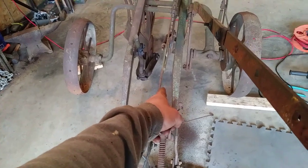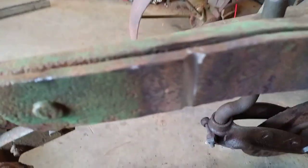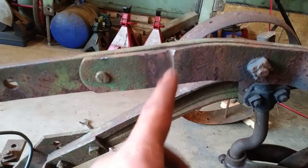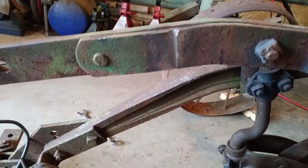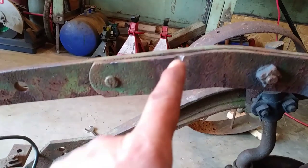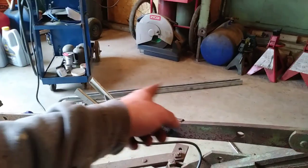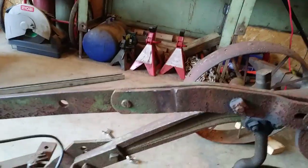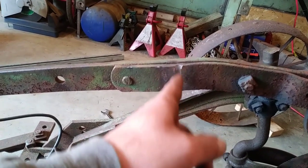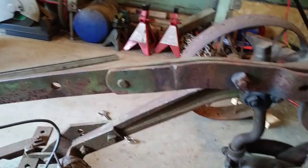This other rod had a bend and a twist — actually a couple of different bends. I had to disconnect it and straighten out the upper half too. When I was trying to straighten this bend out, I was beating on it with a hammer and I cracked it. I notched it with a grinder, but I'll be honest — this is the second time I've had to weld this. The first time I just butted it up, burned it in, ground it flush, gave it a couple more taps — and it popped. So now I've ground a V into the metal and I'm going to weld it, fill that up, grind it flush — that should be a good repair.